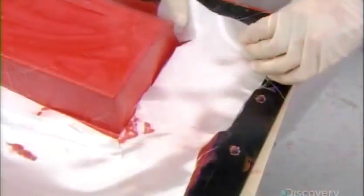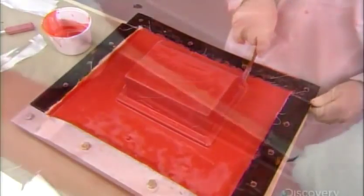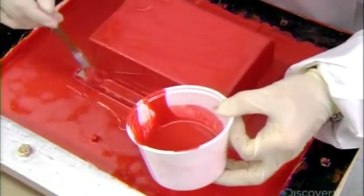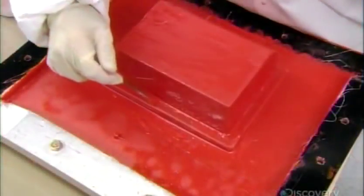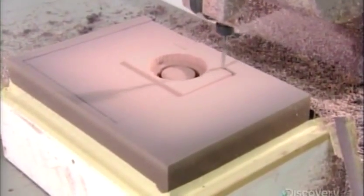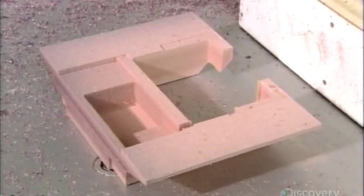The rectangular box on this mold half casts a cavity in the shell, which will house the device's key components. They embed aluminum plates within the fiberglass to reinforce the area where screws will attach the cavity cover. A computer-guided milling machine contours a piece of foam that will fill the empty space inside the shell, and this foam absorbs the force of impact so the flight data recorder can survive a crash.